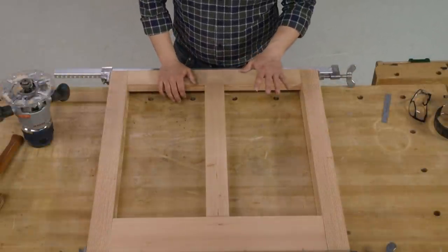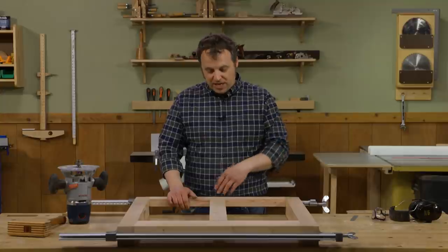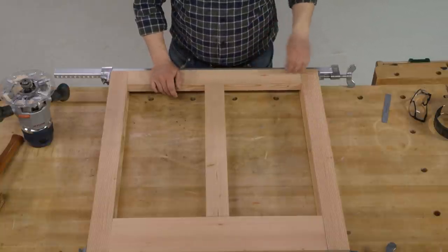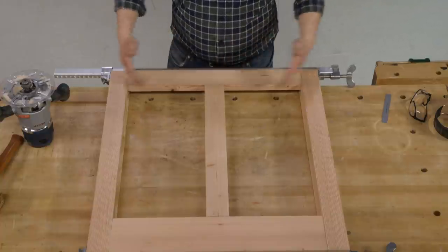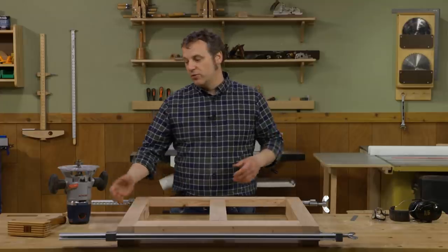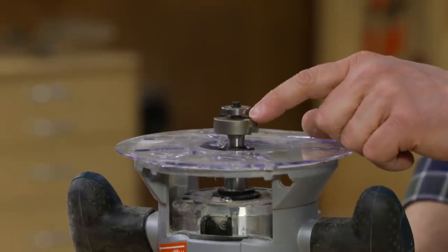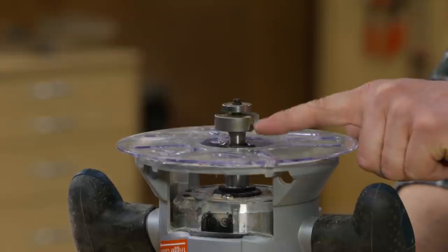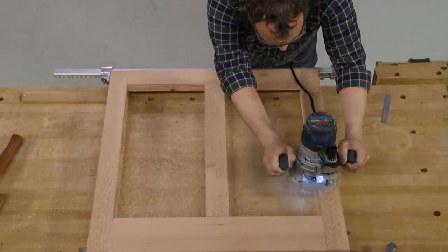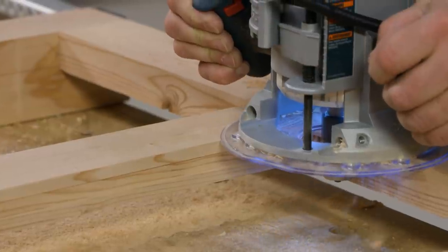The next step is accommodating panels that are going to go in both end assemblies and the back assembly on the bench base. Ordinarily I would take the individual parts to the table saw and run a groove around the inside edge, but I don't want to run a groove where my loose tenons are. So instead I've dry-assembled one of the ends — just clamped it up with no glue — and secured it to the bench. To make the grooves I'm using a handheld router with a rabbeting bit, but I'm not going to make a rabbet. I've set it up almost like a really thick slot cutter, so I can create a groove around the inside edge of each opening. I'm moving the router clockwise, creating a relatively shallow groove — but it'll be enough to capture those panels.